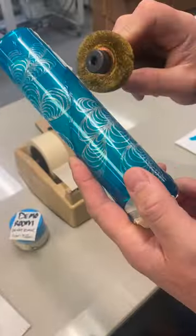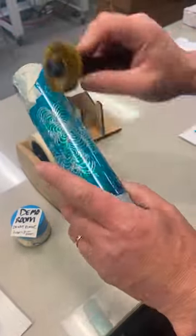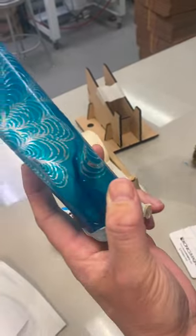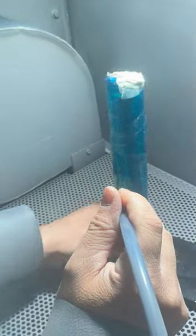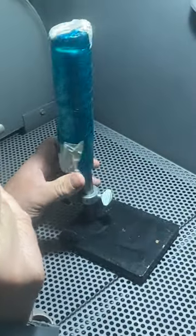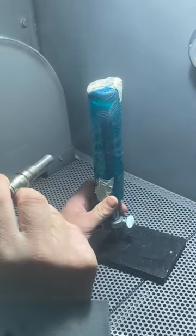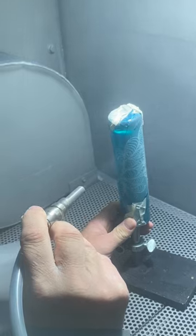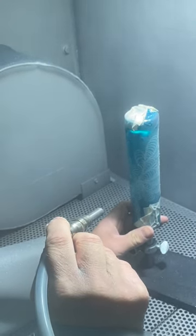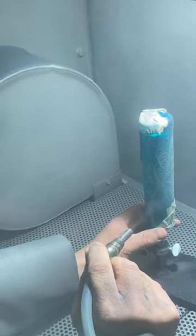I just make sure everything's intact. The last step of prep is you run a wire wheel made of brass wires — it kind of perforates the clear membrane so there are no air pockets, so when you start sandblasting you're not going to have any blow-offs. Next I'm going to load the functional glass into the crystal blast machine from the side door. I'm going to blast at 30 psi with 180 silicon carbide abrasive and hold my nozzle straight on the item at about four to six inches away. The abrasive is now shooting at the mask — all the membrane is removed in one pass, etching the glass instantly. Unlike plotter cut vinyl, there is a very thin membrane holding all the insides of your A's and E's; the islands are all held in place by that membrane. We're blasting that away and etching the glass permanently.